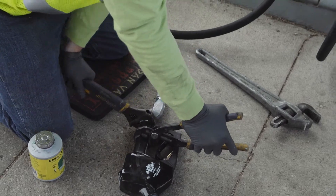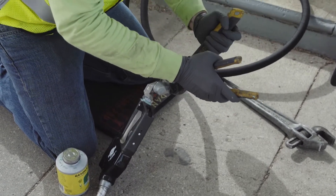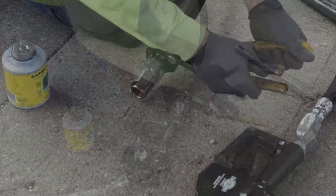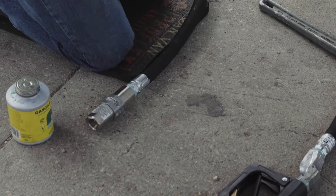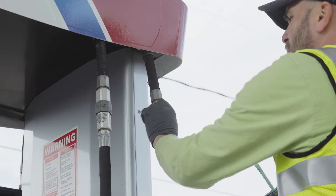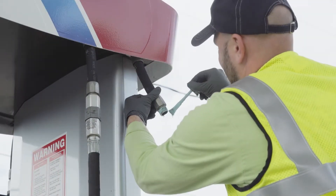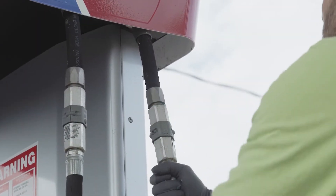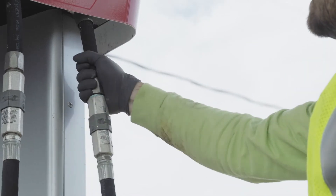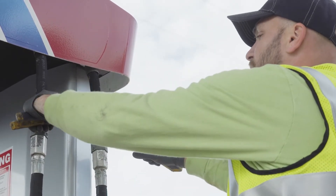Now I'm tight, so I'm just going to go a little bit more, and then you continue down the same way. Now I'm tightening the swivel onto the hose — once I'm snug, I go just a little bit more. The last one is the breakaway. Go back to the whip hose, put pipe dope on that, and then spin on the breakaway. You might have some extra pipe dope gunked up on there — that's where you can use your wire brush to clean up the threads. You don't want to go too hard on it because if you twist up the whip hose, you might damage it and then it might have leaks. That's why it's important to have two tools here so that you're counterbalancing your tightening.